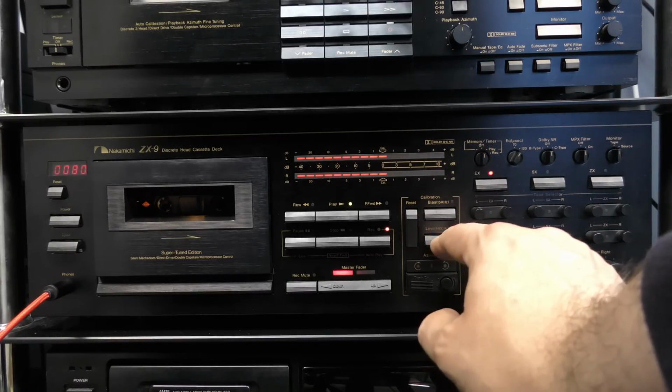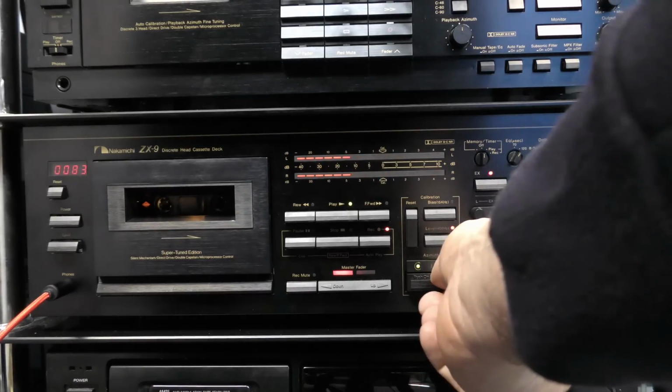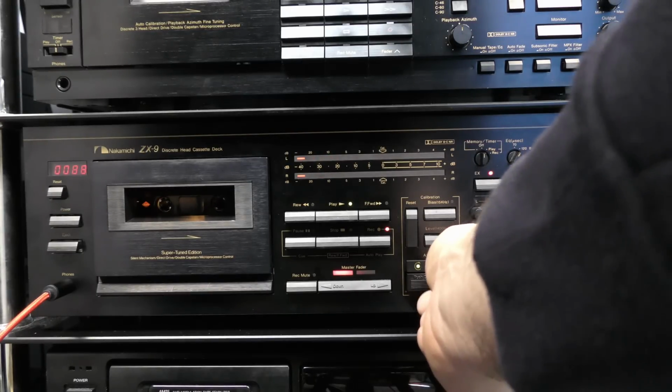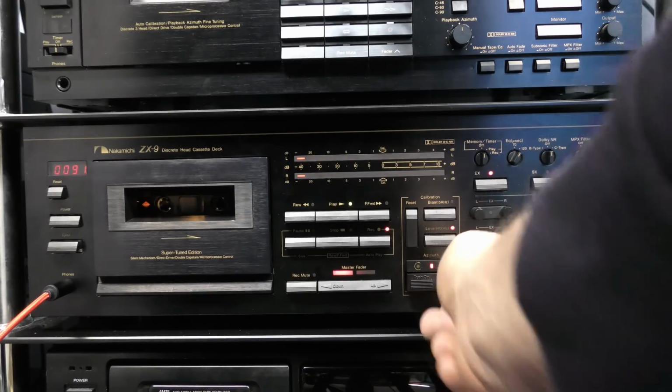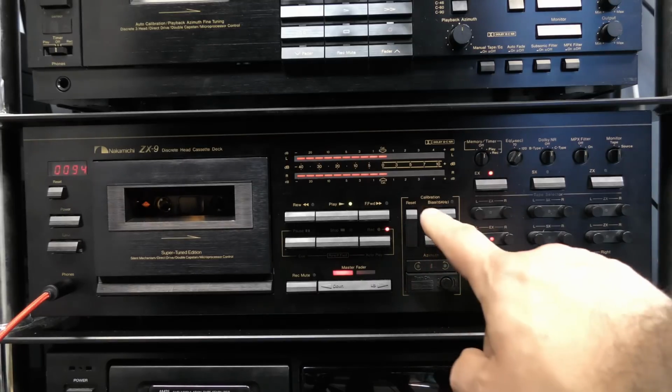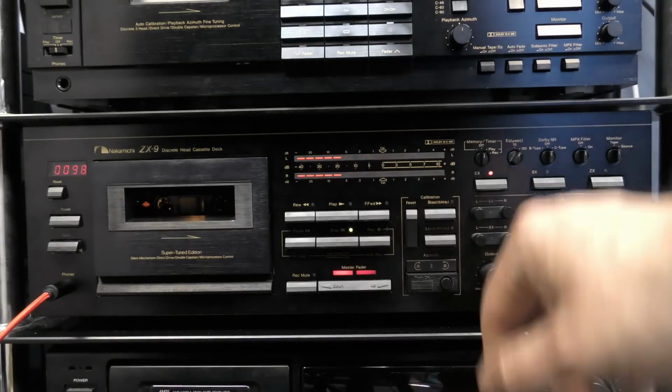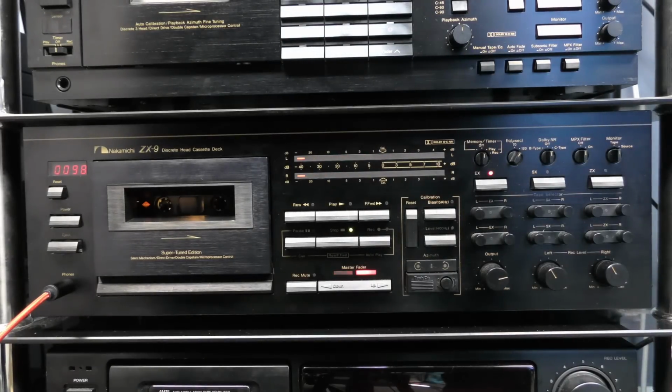Right, bias, level, azimuth. You said the differences between one tape and another. There we go, right. Azimuth is on. Level's fine. Bias is fine. Right, good. So I'm going to record Synergy again, but since it's saying it's a super ferro, I'm going to have it peaking at around plus 5. If it sounds all distorted, well, I'll turn it down. So, yeah, let's do it again. Synergy.